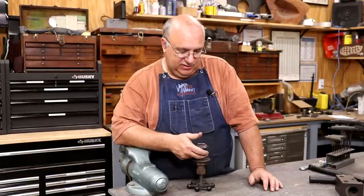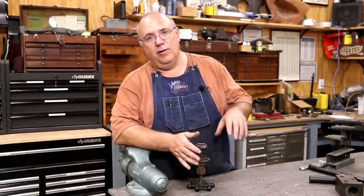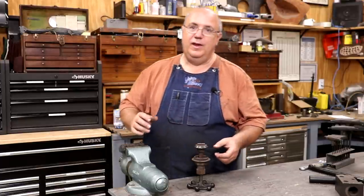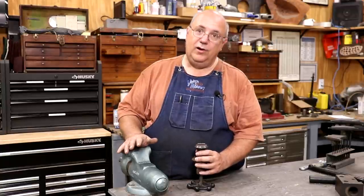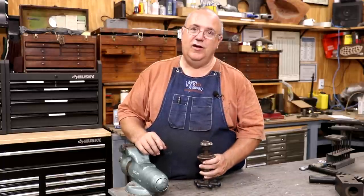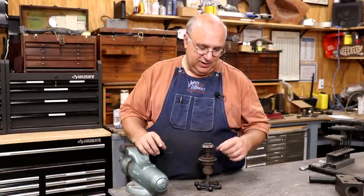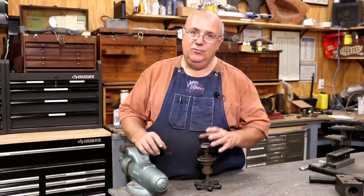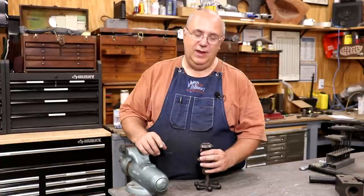Greg reached out to me about a week or so ago wanting to see if I could do a quick job for him on that Frick steam traction engine. He was having his state boiler inspection done, which he needed to do to be able to take that engine around to shows. When they came out to do the inspection, everything looked great, but they were going to do a hydro test — basically filling the boiler completely with water, taking it up to pressure above what it's rated for and looking for any leaks. Well, when they went to pressurize his boiler, he was getting a steam leak — not on his boiler, but on a valve.